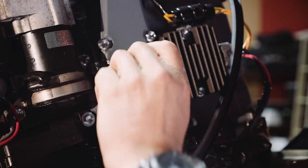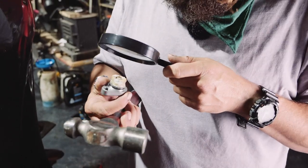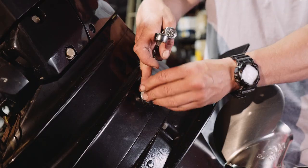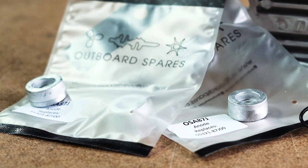Without anodes you'd be left with holes in your water jackets and cylinder heads and all sorts of nasty stuff. And there we go — look at that, it's well corroded for sure. I've seen worse — I've seen just the bolts sitting there actually. Quick, simple, easy — once again, Outboard Spares. So just remember that sacrificial anodes are designed to corrode a lot faster than the rest of the metals in your motor, or your boat for that matter if you're an alloy boat owner.